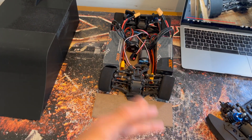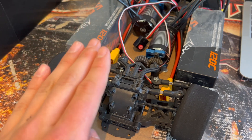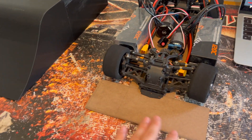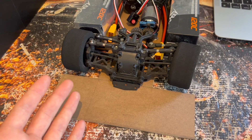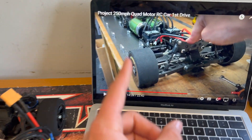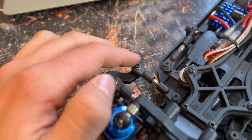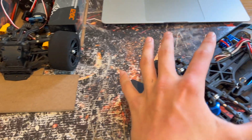In order for the body to fit the car nicely we've had to make some modifications. I've removed the two front shocks and cut off the majority of the front shock tower, because it was sitting so high it was colliding with the front of the body. I could tweak the body design or remake the chassis, but that's a lot of work. These two front shocks were basically futile anyway because no matter what I did, the car was still rubbing along the ground — there's a lot of weight in it for the size and the shocks just weren't up for the job. Looking at Kevin Talbot's new speed car, he's using Lynx shocks as rear shocks. I've got a spare Banzai here and those Lynx shocks could potentially be the perfect size to do something similar for the front of my car.